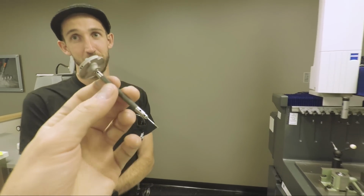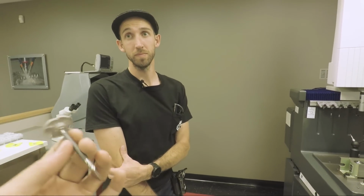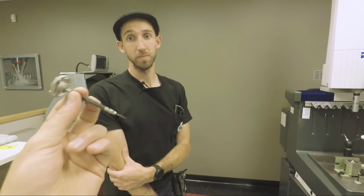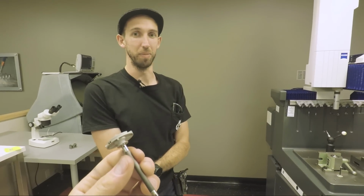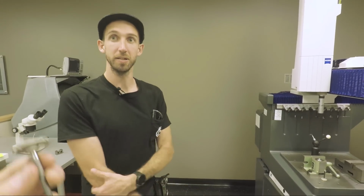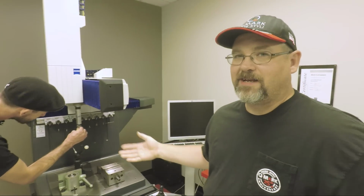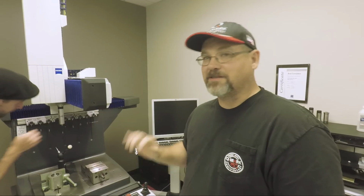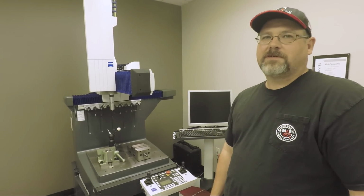The first thing I think about when I think about Heimer tips or Renishaw probes is the breakaway nature, the shear. Is this meant to shear if it's impacted, or is that not a thing on CMMs? It's not a thing that really happens on CMMs. I mean, it can happen. Well, this is breakaway anyway. It definitely has that magnetic release. And the machines are much more sophisticated. They actually sense if something's not right, they'll stop. When I break my tips, it's because I'm not in protected position to move and I'm just jogging around.